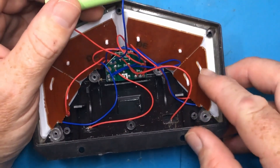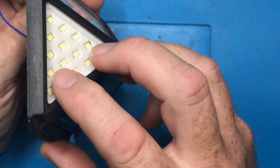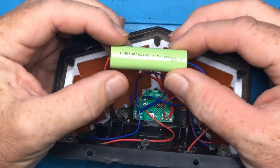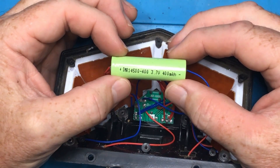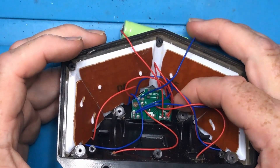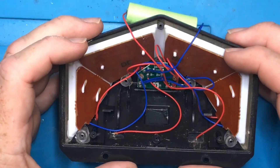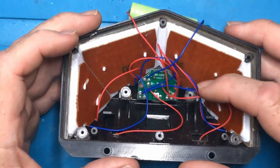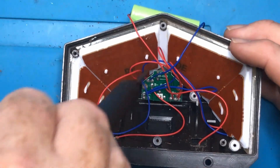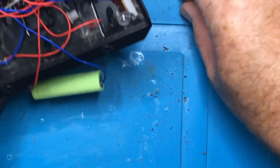So what do we have here? We've got these panels of LEDs, and they appear to be glued in place. We have our battery — this is going to have no charge and this might actually be the problem. It's a low quality battery, as you'd expect — 400 milliamps — and yeah, it may have just failed and maybe everything else works. I can see some rust on the screws on the inside, so it definitely hasn't been completely without dampness inside. It's a very small circuit board; the markings on it are KS-G100.